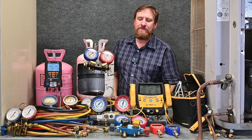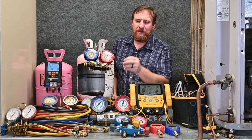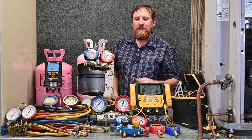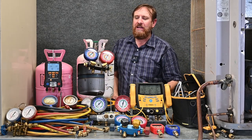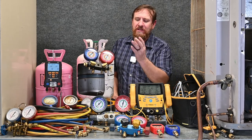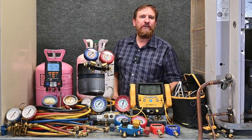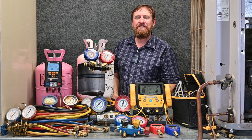Taking care of your equipment goes a long way — not throwing them around, cleaning them up every once in a while. For hoses, keep them out of direct sunlight when not in use. Keep them clean, purged, and keep moisture and contaminants out of the ends. Especially the automatic low-loss fittings — they're notorious for failing because people drop them in the dirt or leave them open and dirt clogs up that little moving valve. Make sure your manifold gauge set stays clear; there are little plugs you can put on the ends. On typical manifold gauge sets you can put the hose back on the other end to keep them clean. Whichever method you use, keep your hoses clean and inspect them — they'll start to leak, get cracked, or dry out. I typically replace my set of hoses every year and use the older ones for other jobs like nitrogen or flushing drain lines — they still have some use even if leaking.